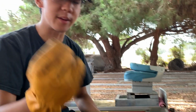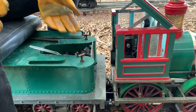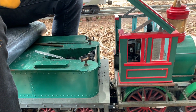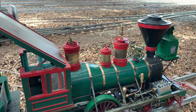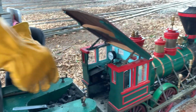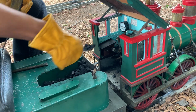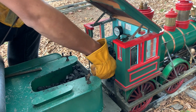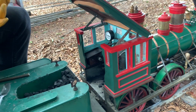But there's a lot of sitting and waiting with this locomotive. Because the boiler is so small, every extra pump that we give her lowers the pressure by 20 pounds. Every time we open the firebox door and shovel her in, if we're not moving, we don't have extra draft from our cylinders, and therefore the fire is not as strong. So that's why it's always the most difficult part of getting on the rails, moving, so that you can get the water pumps working. You don't have to pump water anymore. You get off of the cycle of worrying about pressure. Pressure, pressure, pressure. It's always pressure.